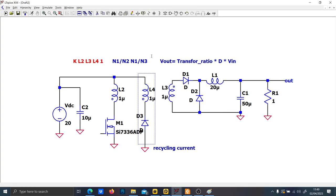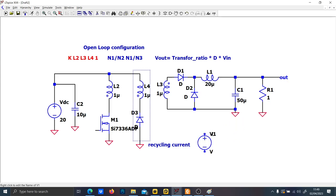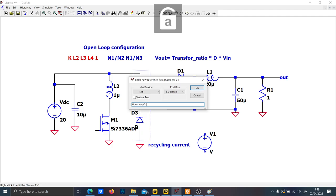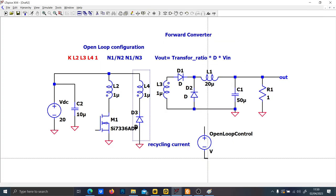This is an open-loop configuration — in this video I'll do the open-loop configuration and then I can export the PI controller as well. Let's write 'open loop control' and I'll decide the duty cycle to test the forward converter. When the waveforms are correct, we can think about adding a closed loop with a PI controller. You should use an optoisolator to separate the grounds, but for this LTspice simulation we'll skip that.